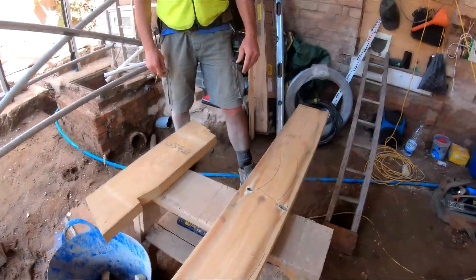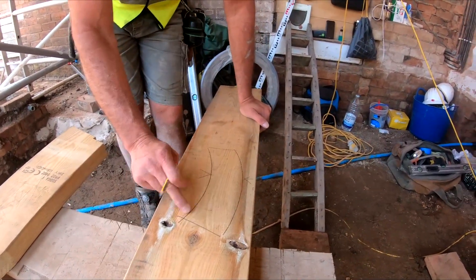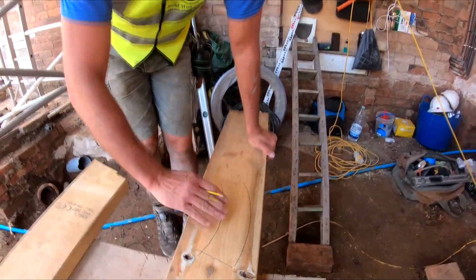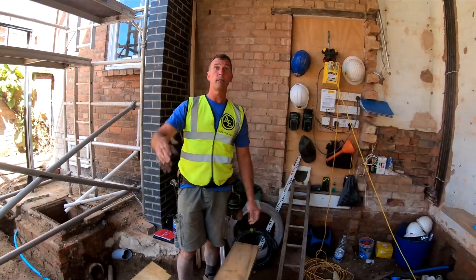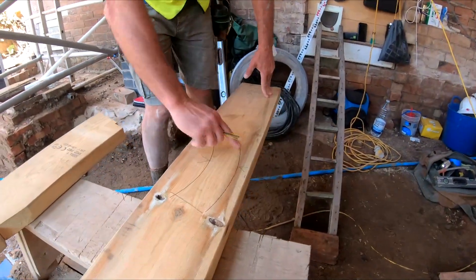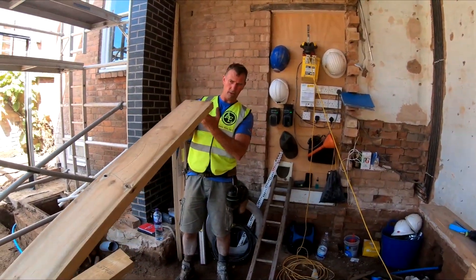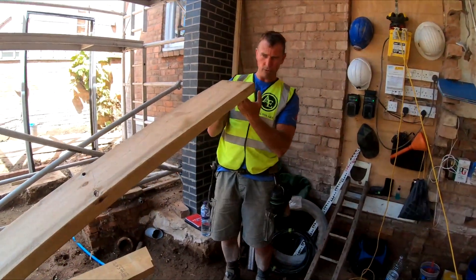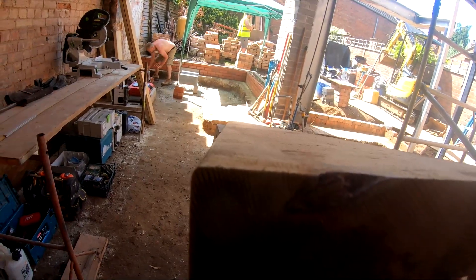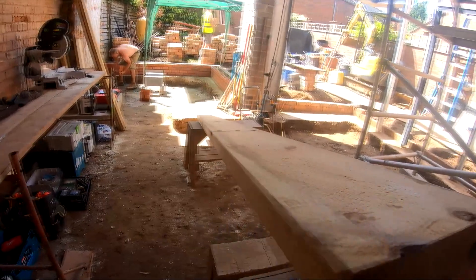Why do you do it that way around? As the weight of the roof goes on it will slightly push that down. If you did it the other way around, your ceiling underneath will be really difficult to pull out and your roof will look really wavy. If the roof's too cambered, you'd never use the rafter — there's always a tolerance. This one is really quite straight on top; it's just the bottom that has a camber. Whereas the other one has a camber — we don't want to be using that.